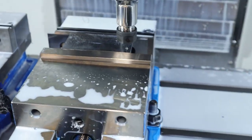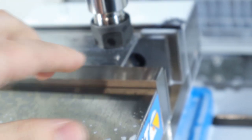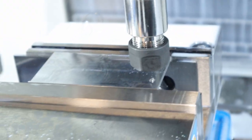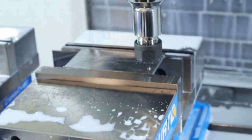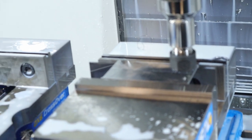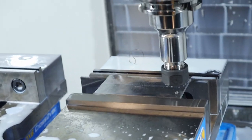Boys, we've done it again. The bore operation bit me. Oh, that's very sharp, I should definitely not be doing that. So the facing went good. You can see there's a little bit of material left before we hit the jaws, so always playing it close. For the bore operation, you need to make sure it's doing the correct bore in the correct sequence, because apparently Fusion doesn't default to select the correct sequence, so this kind of stuff happens.